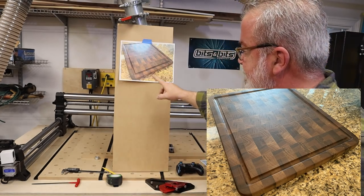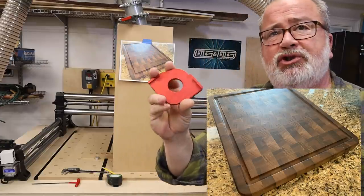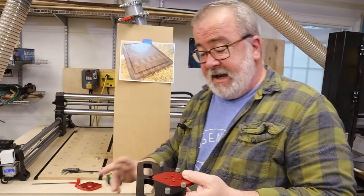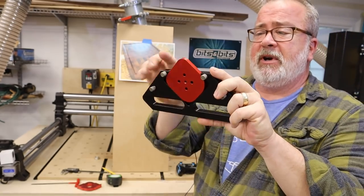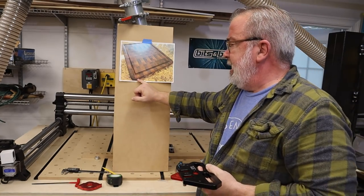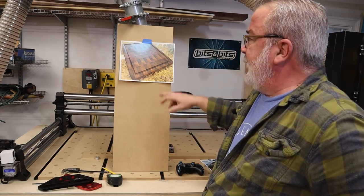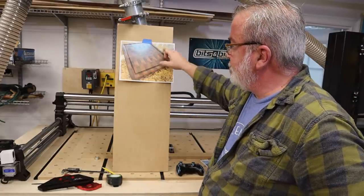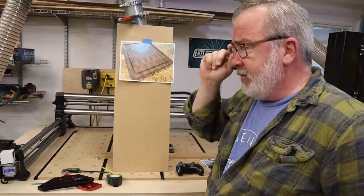If you are cutting a rough shape and then using something like a radius jig to achieve that corner — you lay this on a board and you're going to use a flush trim router bit. Because you're going to come around end grain, this is sometimes a dangerous maneuver with a handheld router. By using a CNC machine, I can put a blank on my CNC and have it cut out this profile — very consistent, the same speed, the same radius every single time.